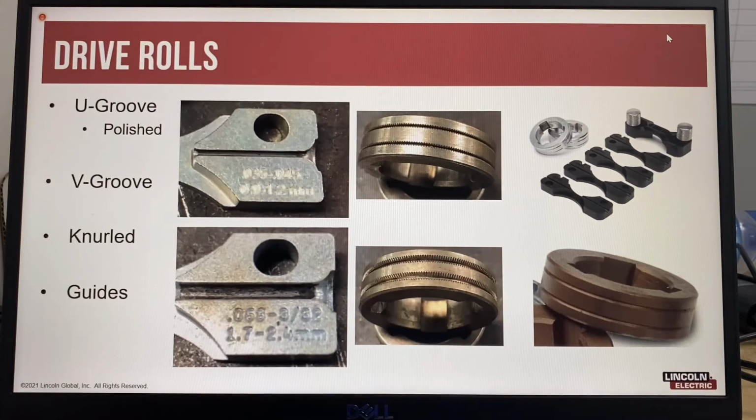When setting up welding equipment, best practice should ensure the correct type of drive rolls are used for different wire types. Aluminium wire requires a polished U-groove type drive roll and Teflon wire guides. This is to prevent contamination and deformation of the wire.